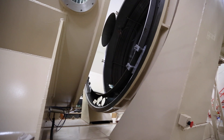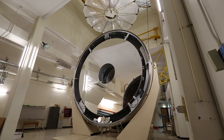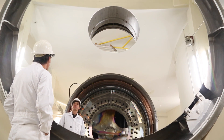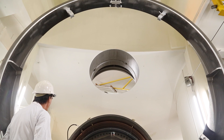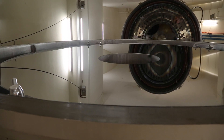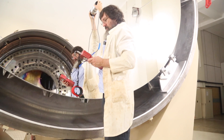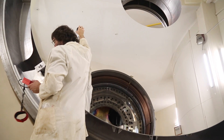One way of thinking about this mirror surface: imagine it not being 3.9 metres in diameter but expanded to the size of New South Wales. Its smoothness would be such that the biggest inaccuracy in its surface would be about the size of a pencil laid on its side. The layer of aluminium on the mirror surface is only about 100 atoms thick in reality — but imagining the mirror blown up to the size of the state, it's a layer perhaps 20 millimetres thick.